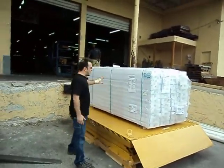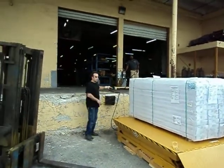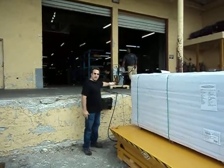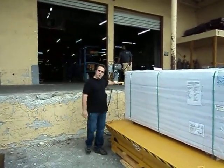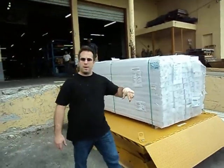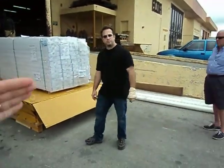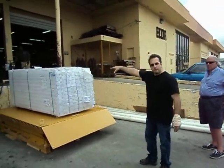So what we're doing with the wider pallets, we're not going to be able to put it in this direction. So we drive the forklift, we back the forklift onto the scissor lift, we drop the load onto the dock, get the forklift on the ground, and then we're able to pick up the load over the rails and bring it in and load up, and then the forklift would come down. That is correct. It would back down. Back out of it with the load from the dock.